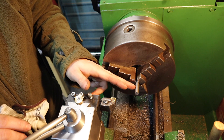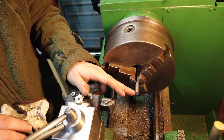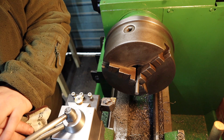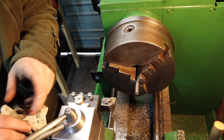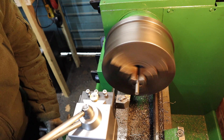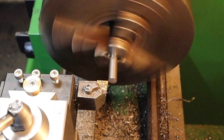Let's move on with the threaded section of these pins. Currently the outer diameter is 10 millimeters and we're aiming for an M8 thread, so I need to turn these down — I'm going to aim for about 7.9 millimeters, giving myself a little bit of wiggle room when doing the threaded part. First process is to turn these down. I'm going to stick to a one millimeter depth of cut because that gave a really nice surface finish on the last part.